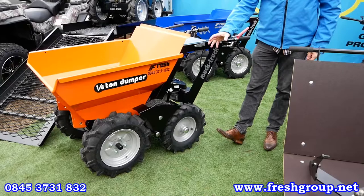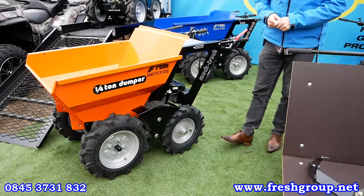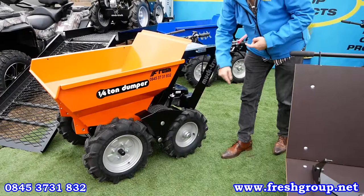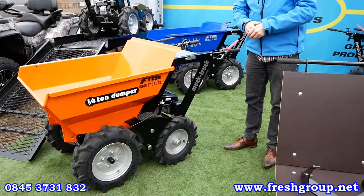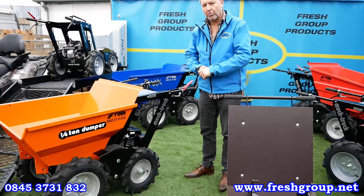We have all six wheels — four ground wheels and a power drive conversion wheel. When you're driving and you select gear, as the front wheels drive forward the middle wheel revolves backwards, and because it's under friction contact the back wheel is driven, giving you the four-wheel drive system developed by Muck Truck. Keep your tyre pressures between 30 and a maximum of 35 psi — 30 to 32 psi is ideal — and that will give you optimum drive in poor ground conditions.